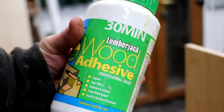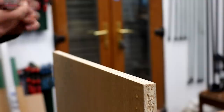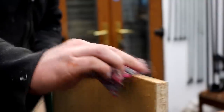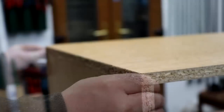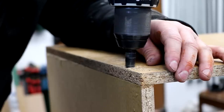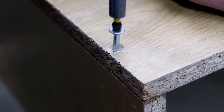I'm going to use polyurethane glue on this project rather than the usual PVA, mainly because it does a better job at bonding the plastic face of the boards to the chipboard substrate, but also it's less temperature sensitive and because it's cold in my workshop it will dry much quicker. You can find this adhesive in the my tools section in the description. This glue works best when activated with a bit of moisture, so I used a damp cloth over the glue joints before applying. Then I can start assembling the pieces, drilling pilot holes with a countersink and adding screws so I can continue working without waiting for glue to dry.